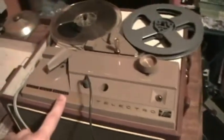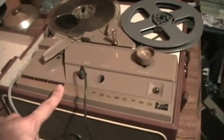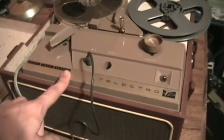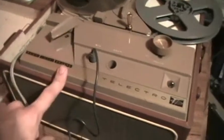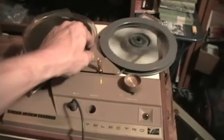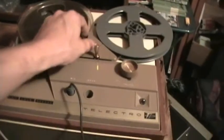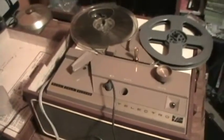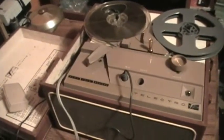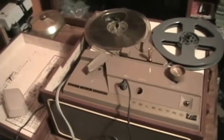I recommend, if you don't know already, do not under any circumstances hook a hot chassis, which is an unisolated chassis, meaning your circuit is not isolated by a power transformer. Never under any circumstances hook a hot chassis circuit to a computer. I hope none of you have tried it already, but back in 2004, a home-built tube amplifier that I had, which had a hot chassis, did not use an isolation transformer for the plate supply. I plugged it into the computer's audio output, and I literally saw a spark jump across as I plugged the jack in, and it fried the motherboard.